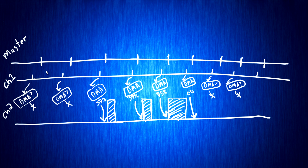Here at the top we have little marks at every single time the master clock rolls over — this is the beginning of each bit timing. Then we have channel 1, which is set to fire just before the clock rolls over. Every single time that fires, we get a DMA event. When DMA is disabled, it fires the DMA interrupt request but doesn't do anything. Same with the second bit — DMA is still disabled, it doesn't do anything. When we come to the next one, channel 1 fires, the DMA triggers, and now it's enabled.